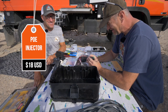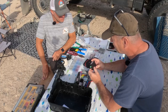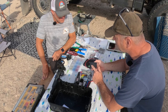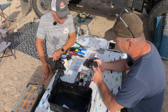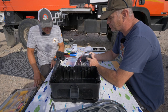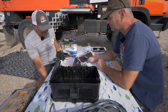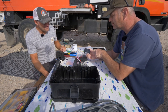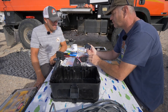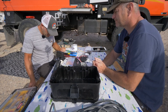The last thing we've got is a power over ethernet injector. This takes 48 volts in, and on the POE out leg we put our cable going to the dish — 48 volts gets injected over it. On the other end it's just standard data with no power, and that goes to our router.